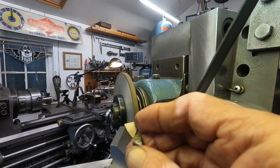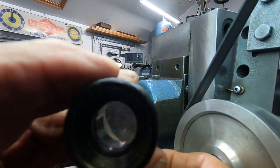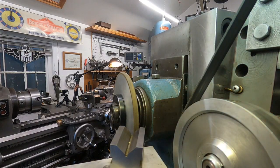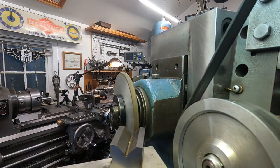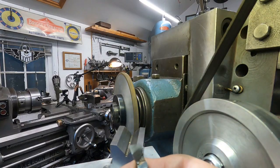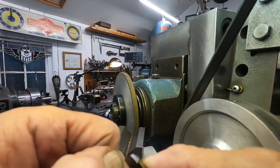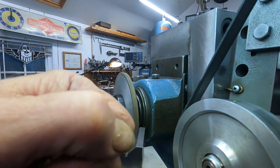Okay, now I can tell you what it is by looking at it with this. I'll do that real quick here. And that nose radius is right at 20 thousandths. Now it's about 5 over, but I'm going to go with it because let's just see if I get a smoother bore over there on the milling machine. Oh, very sharp, very sharp. See it shaved my thumbnail? Oh, okay, we'll get over there.